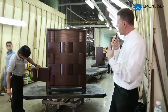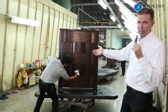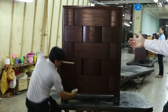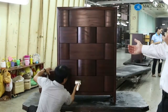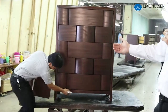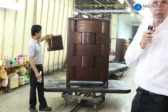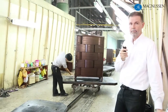In order to ensure that we keep color consistency, you'll notice that the technician has a wood panel — that's called a color reference. He uses that as the standard to make sure that as he goes through the product, we've got the right-looking color. You'll notice how he's taking some application in order to change the color slightly to make it more similar to the color standard. Using the color standard from production to production, piece to piece, ensures consistency for the customer, whether they buy a piece today or an additional piece to their collection years from now.